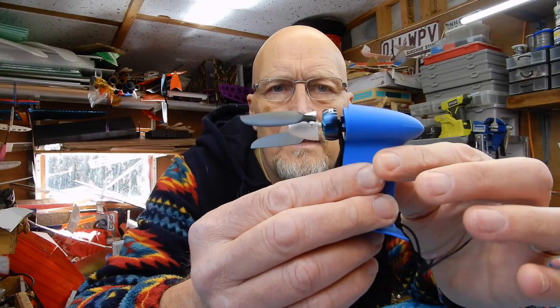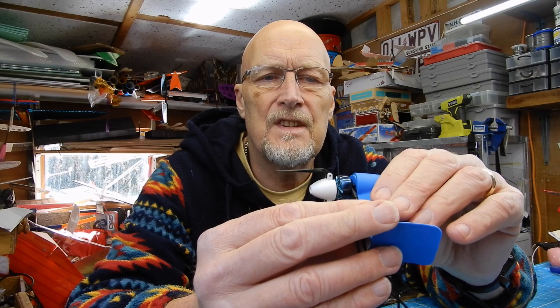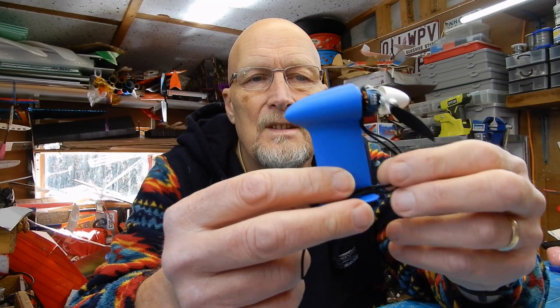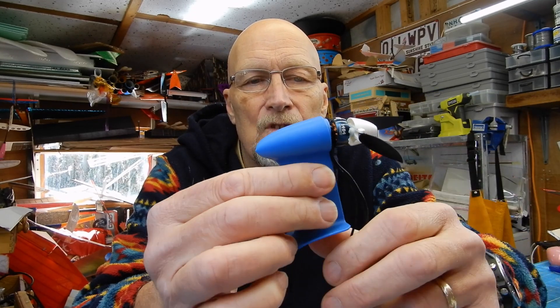The motor mount is on — look down as well to make sure you've got it lined up through the center. I've used a small dental bur — that's my previous background, so I'm quite lucky — like a little milling burr, and I've just drilled a hole through the pylon. It means you can tidy up the wires, because what you don't want is them flapping about. You could hot glue them to the side, but feeding them through looks neater.